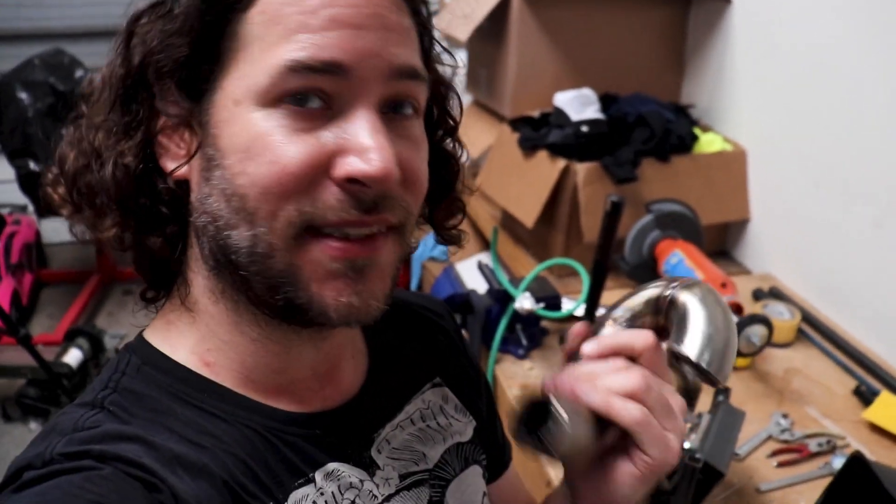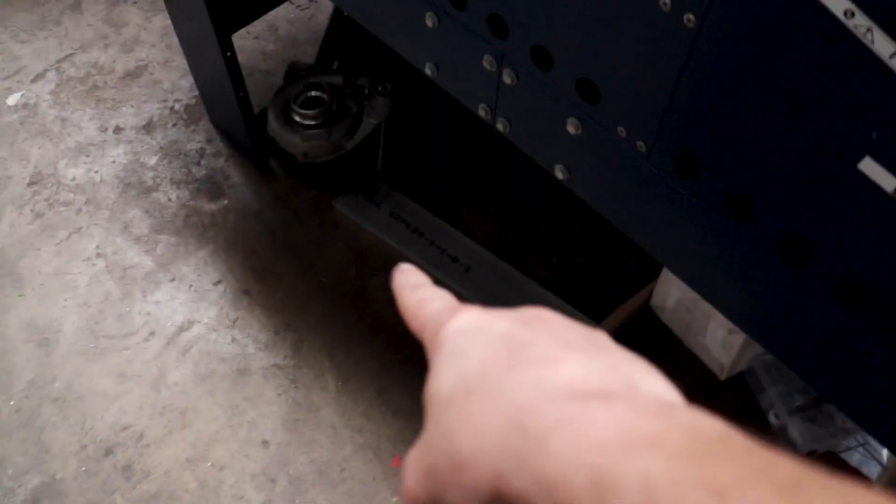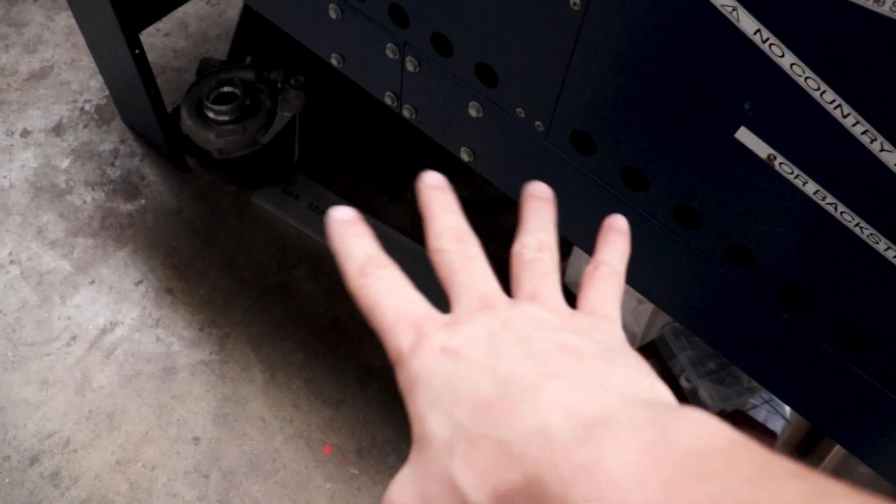Since the camera's last been off, I've got three runners almost completely welded up. I'm going to have to take this out of the jig to finish up some of these welds back over here where I just cannot reach. In between here has been the biggest pain — there's one little spot in there where it's very hard to reach and the gas is having a hard time shielding the weld. Let's go ahead and tack up the last runner, weld as much as we can, then take it off the jig to finish up the welding on the flange. We'll use that piece of aluminum as a heat sink, but I need to drill and tap it first. We're on the home stretch.